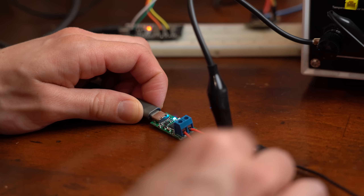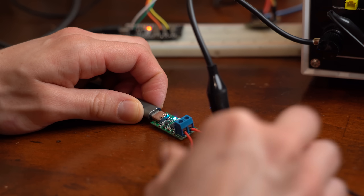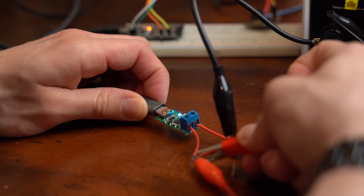Before getting to PPS, I tried outputting the 15V fixed PD voltage by simply using a command with the profile number for 15V and a max current of 1A. After uploading, we immediately get the requested voltage, which does in fact come with a current limit of 1A. However, the power bank itself is still on and outputting 15V — what cut the current was the output of the breakout board, utilizing its two MOSFETs, which is a pretty neat feature to have.